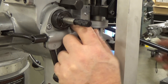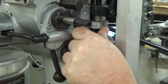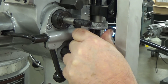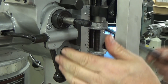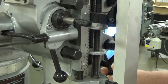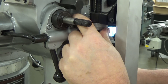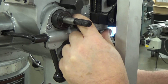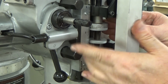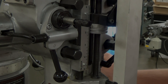This is a close-up of your quill stop. You have a scale on this side and a graduated scale on the other where you can move it down. Each rotation is 50 thousandths of an inch. So if you can get it to stop on a part and you want to move it down a hundred thousandths, you can touch off on your part, bring the knee up to your part, then move this down two full turns. You can also use the locking nut — spin it up to lock it in place — and that way you will only engage that hundred thousandths of movement.